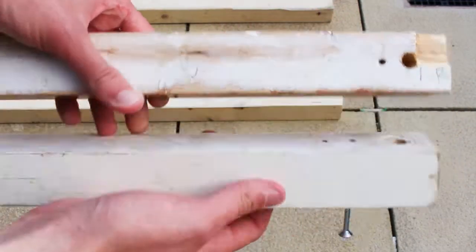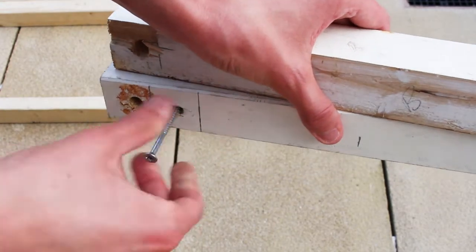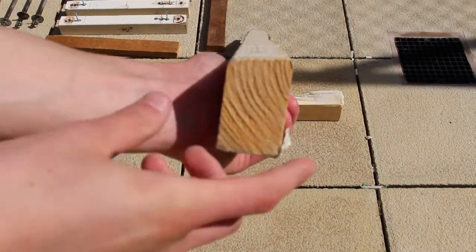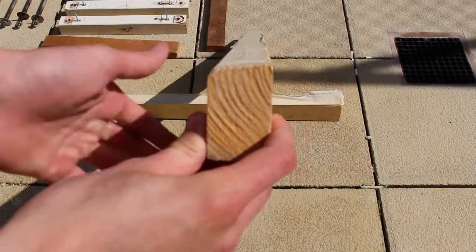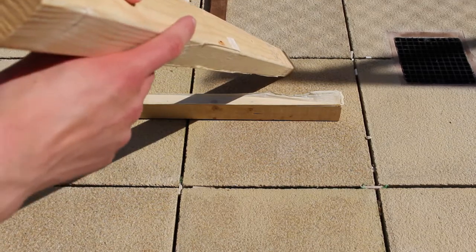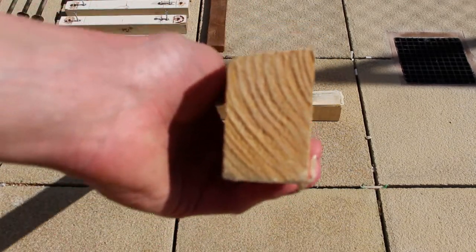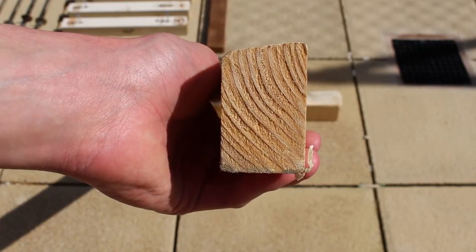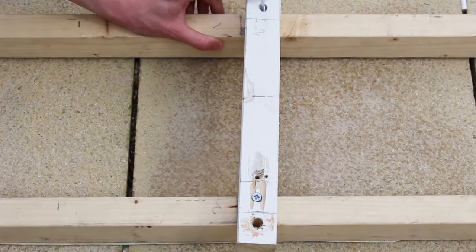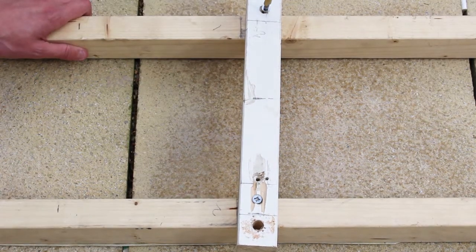You can change it to whatever you want. These two roughly 2x2 inch pieces have two pass-through holes in them for the threaded rods, and just a simple pass-through hole to mount it to the base. The bit that the board rests on has a 20-degree chamfer on it — sanded down and rounded off at the edges. This makes sure that the board starts bending from the outside edge so you get a larger bending radius. It also means there's more surface area around the corners where it's very important that the board sticks, and it will prevent anything leaving a mark on the underside of the board.